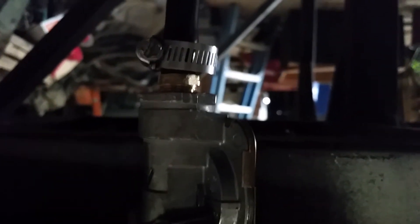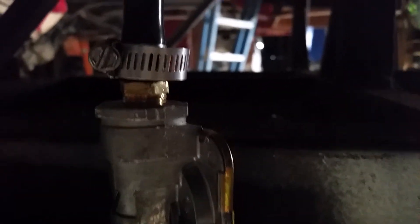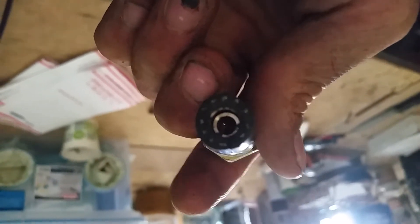It came with this end, so I cut this end off — because this is the wrong thread size for that fitting. I do believe you need a compression fitting... actually, I'll go with the MIP. Better yet, just bring your pressure regulator for the natural gas stove in to the store and that'll tell you exactly what size you need. I cut this with a metal hacksaw — very easy to cut through. You want to use a metal saw because there is a metal wire strand inside here.